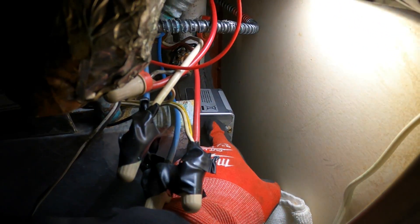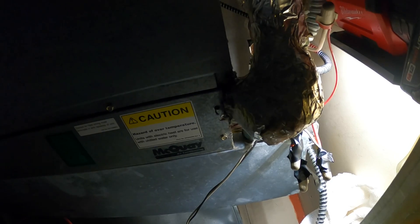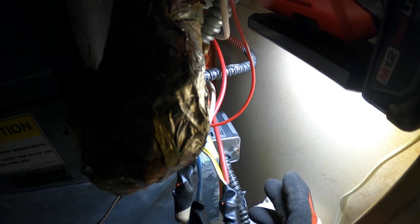Right here we have the actuator for the zone valve. If you listen closely, I can hear water just passing right through it. Right there is the actuator — you can just hear the water squeezing through and there's no power. There's the spring return; it just springs back and closes. Try to listen to the water.